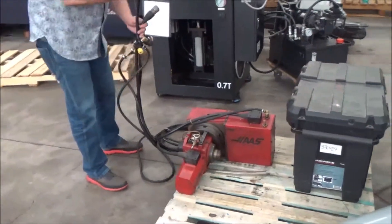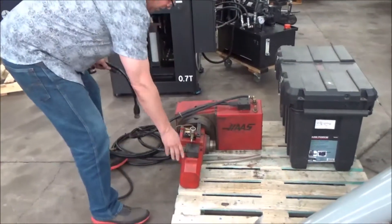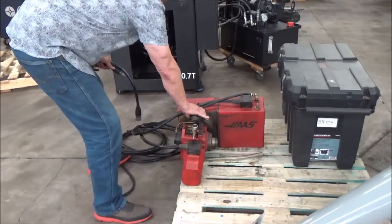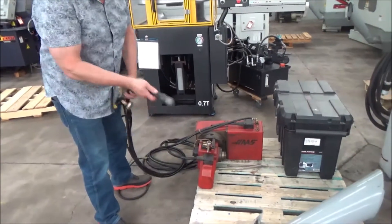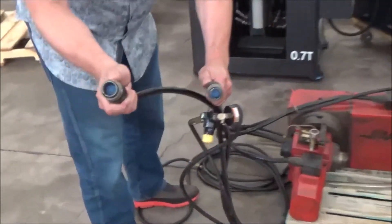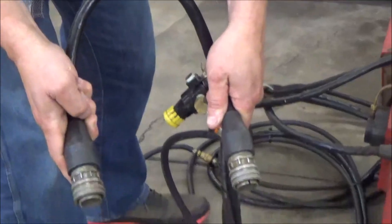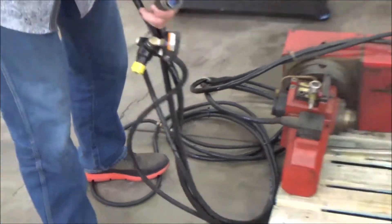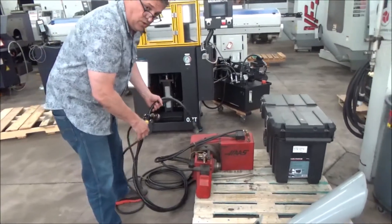It's older, it's red. But here's the giveaway — there are only two cables, and there are two motors here: a motor for this axis and a motor for this axis. So if it were brushless, it would have four cables, two for each. This is brush — it just has that large 19-pin connector for each motor. So that is a brush drive tilting rotary table.